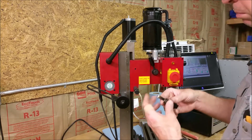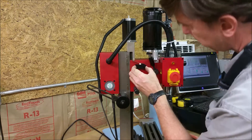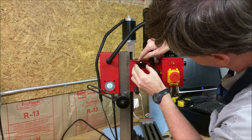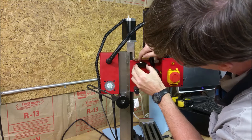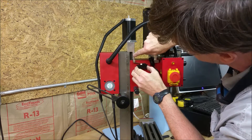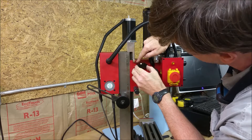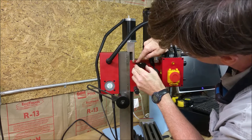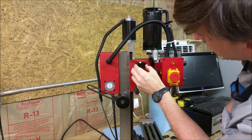I'm going to put my first micro switch for the Z-axis. I'm going to mount it right about here. What I'm going to do is mount a piece of aluminum right here, maybe half an inch thick or something with some slots in it. Let me go ahead and drill this and tap this and get this mounted.